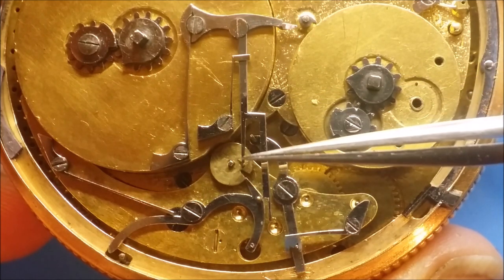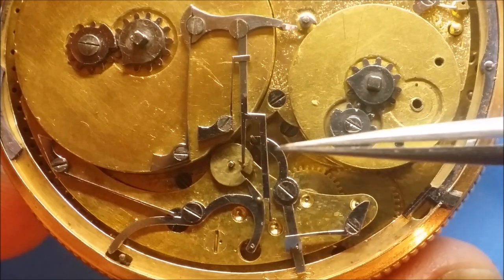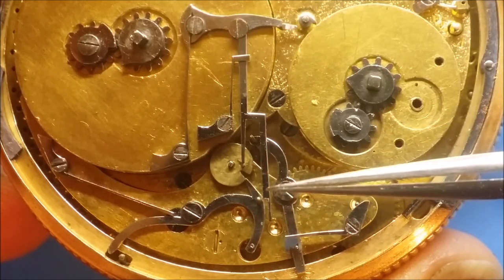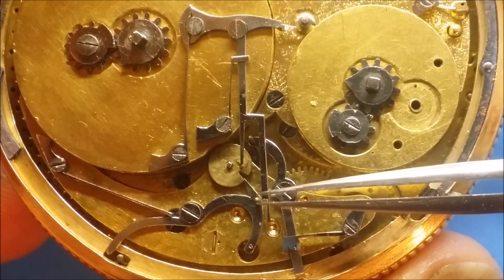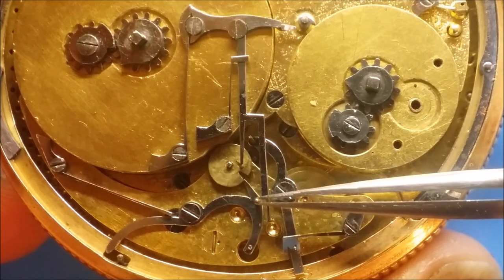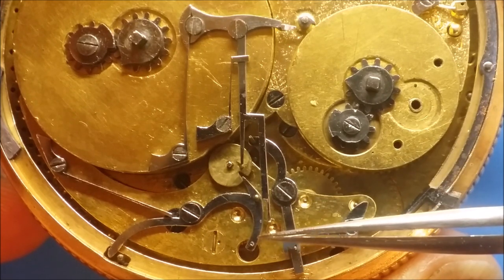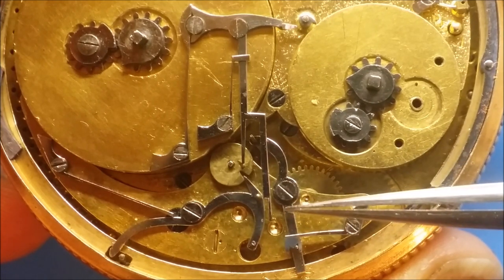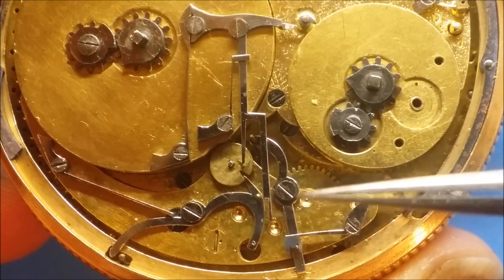This is the spring that holds this portion perpendicular to it, and this spring is constantly applying pressure pulling it over to the left. Down here, this part of it interacts with a pin that is on this cam. This pin moves the whole assembly — as it's pivoted up here it moves it to the left or to the right. And down further here, this little notch interacts with the pin here, lifting this lever which is the lever that stops the whole function of the music box. You can see that there is a pin underneath that goes through the bridge and engages with the gear, stopping the music box and the power running through the gears. When this lever falls into this slot, that's when the music box stops.